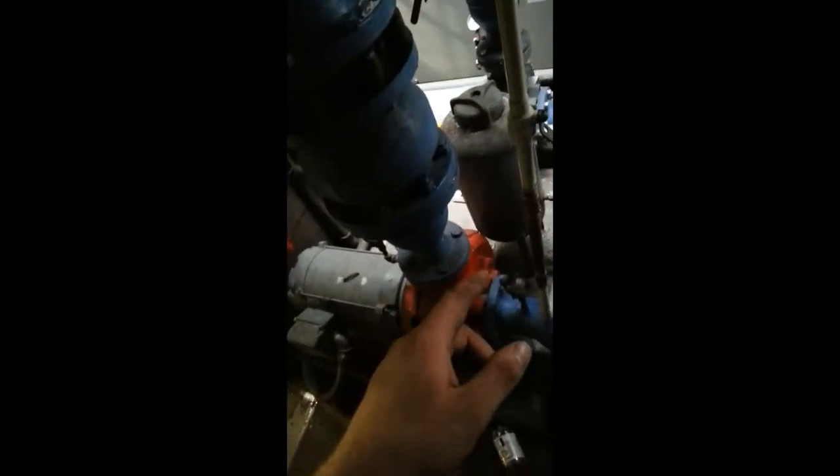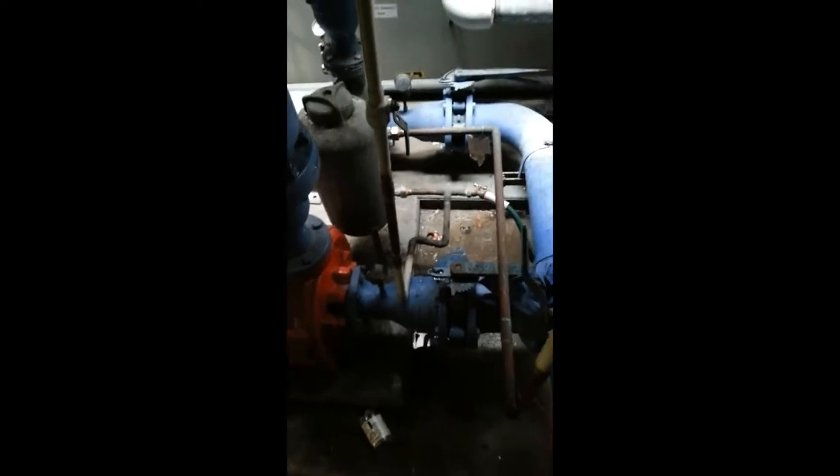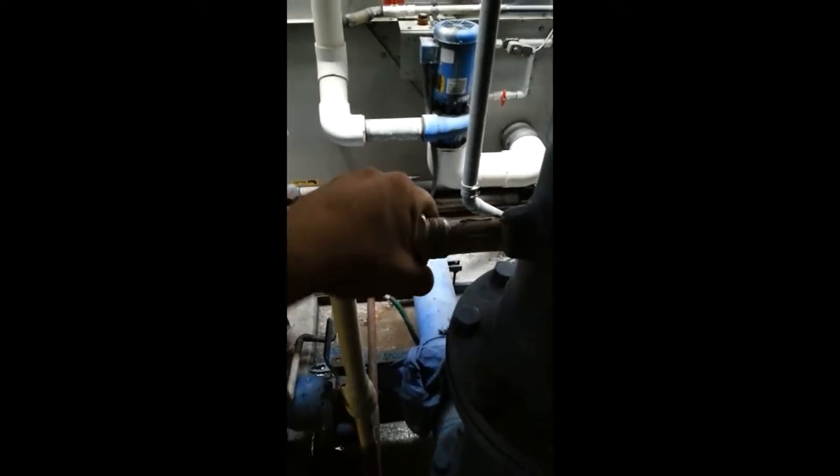We have our closed loop off today for some underground pipe repair. I'm going to work on something I haven't been able to isolate without the whole system off — kind of foolishly designed. You see these have isolation valves for the tank here, so in theory you can work on the pumps or whatever you need to do. But what I don't like is that there's a rubber gasket right here that could leak with no way to isolate it.